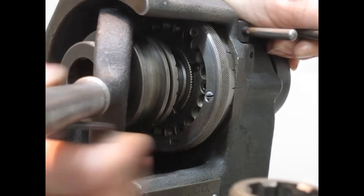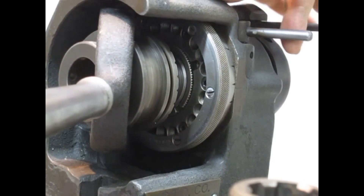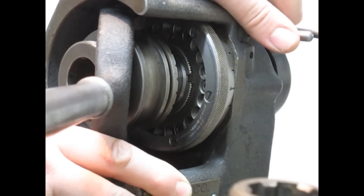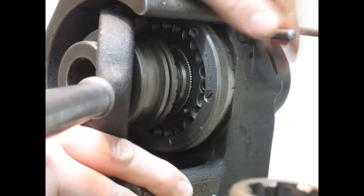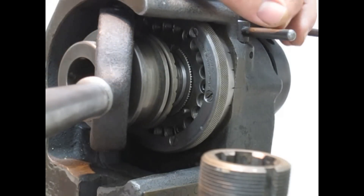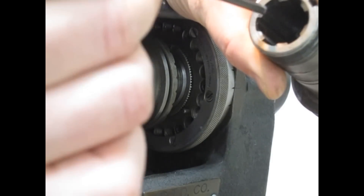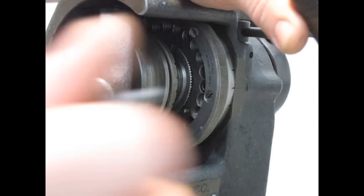So I've got: one in, one-two-three, one-two-three, one-two-three, south - there's my pattern. Now when it comes time to actually use this and crank it up, it locks into position. When I'm done a pass I pull the pin out, get it off axis a little bit - the pin is spring-loaded but it won't lock in until it gets to the next spot. Then boom, next position. That gives me a surefire way to accurately index, and the bonus is I can return to any spot accurately and just take a few more passes to open it up slightly if needed.